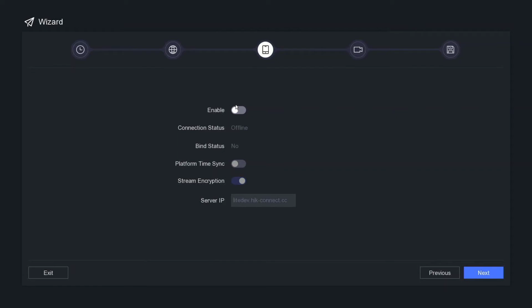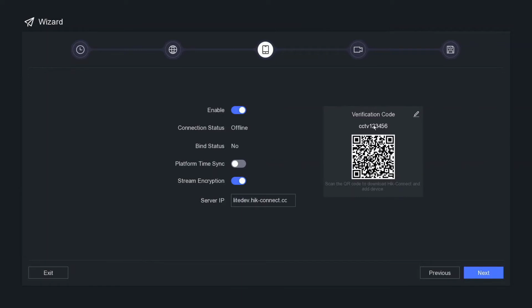So the app to use is Hik-connect, or you can use Hikvision, which is on the App Store. Hik-connect is not on the App Store, so check the links below for more information about that. So now we've enabled our app, we've put our verification code in, bind status says no. Okay, so if that says yes, then make sure you can remove it from here. If you're getting problems in your app with bind, just check out the link below.